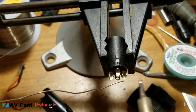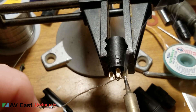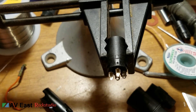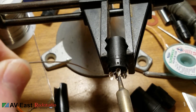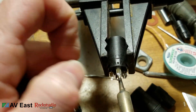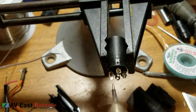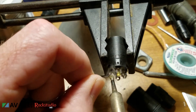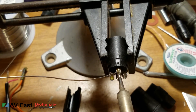Between hot and cold you're going to use your colored conductors. Typically red would be pin 2 hot and black would be pin 3 cold — it's not critical as long as you use the same color code on both ends. In fact, it doesn't matter at all on this specific cable because we're going mono balanced to stereo unbalanced — we're making a double mono unbalanced cable, which is simpler than it sounds. We're just going to connect both colored conductors to pin 2 hot, and that will spread out across tip and ring, so the left and right channels of your recorder get the exact same signal. You can see here why you'd want a wider tip on your soldering iron — you've got to fill those XLR cups all the way up with solder.